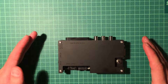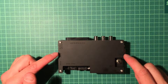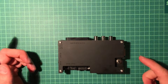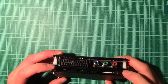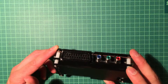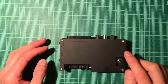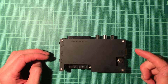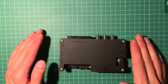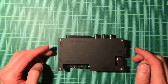There are other solutions out there. I've tried a cheap converter, about 10 euros or so from Amazon, but they usually fail at the low res DOS text modes and graphics modes, and they probably also fail with the retro gaming consoles. Another advantage that some people like to stress — it's not that important for me — but this thing basically introduces no lag at all. It works on individual scan lines and pumps them out via HDMI, and will not buffer any frames, so you don't even have one frame of lag.